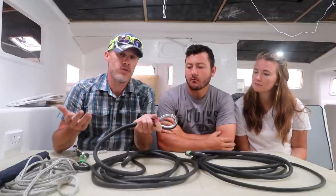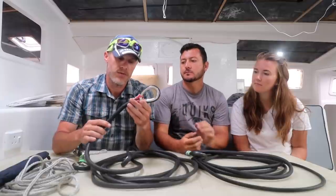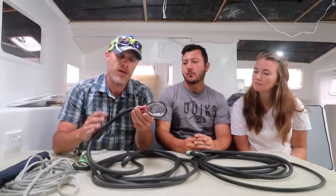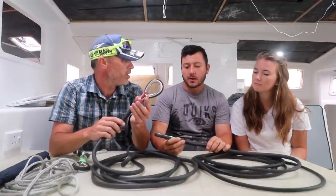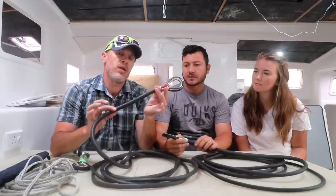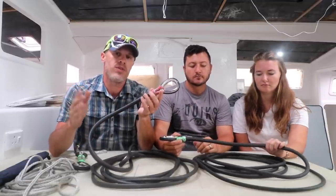It's a little more time consuming to tune the rig than it is with turnbuckles, but once you get it set, and, you know, some of the difficult things to work with in Dyneema after you do the splicing is pre-tensioning. If you pre-tension these, we put probably about a good metric ton of force, and that sets the splices and it takes the construction stretch out. So you don't have to deal with that.